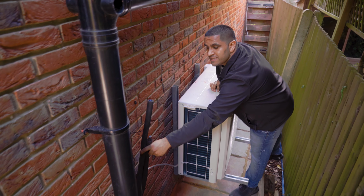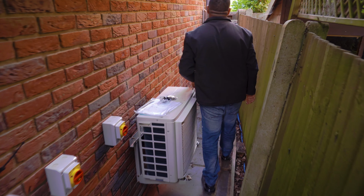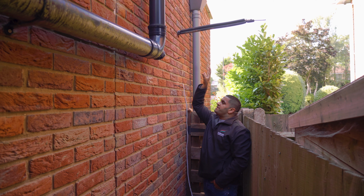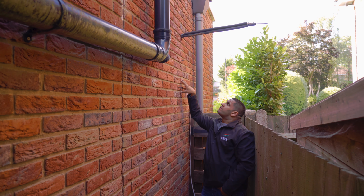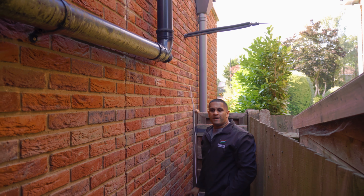These are the services. And this is the outdoor unit. So if you want to follow me over here and look up at high level, poking out are our services. This is the first room that we went into when we walked into the house that we said was the office. So, high wall mounted unit, drill a hole, run the services behind. They're going to be surface mounted and they're going to go to this smaller air conditioning unit to give you a back-to-back installation. Let's go upstairs and see how things are progressing.